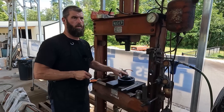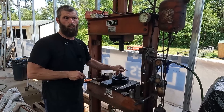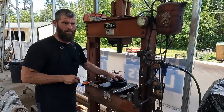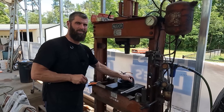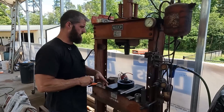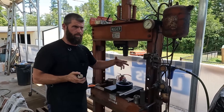The bore is about one-point-480, one-point-479 — that's like 35 to 37 and a half millimeters. I don't remember the exact metric, but it comes out to one-point-480 roughly.